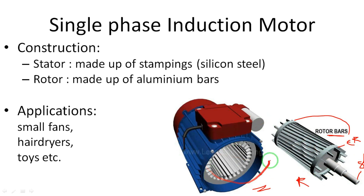In the outer part of the frame there is a capacitor — I will explain its advantage later. The stator stampings have slots in which the armature winding is wound. So the stator consists of armature winding wound in the slots. In the rotor part there is no winding at all — it consists completely of aluminum bars.